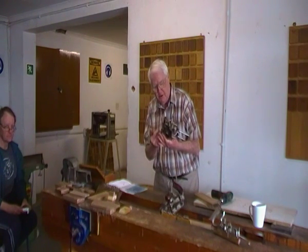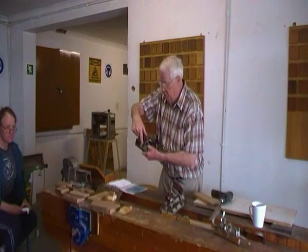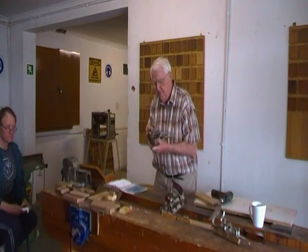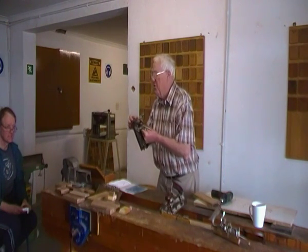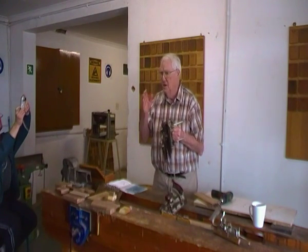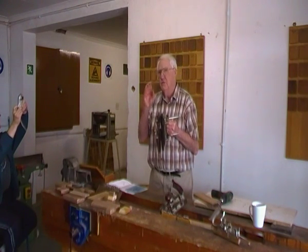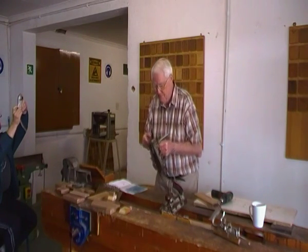It's got the splitter, the fence. It's also got two fences. You can put two, not fences, I think you're putting depth stops. But the thing that makes this unique is it's got a third ski. If you can see in the middle here, it's got a third ski, which you only use on certain cutters. On the wider cutters, which are fancy profile, it gives the support in the middle. Otherwise, you get a lot of rip out and tear out.